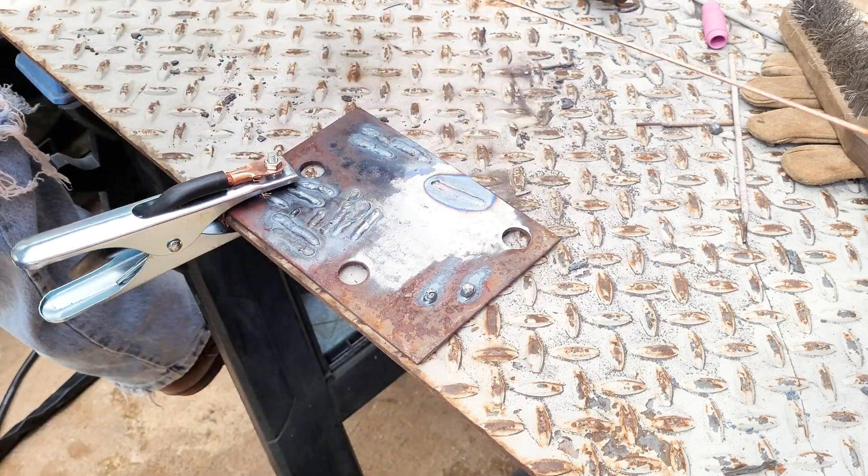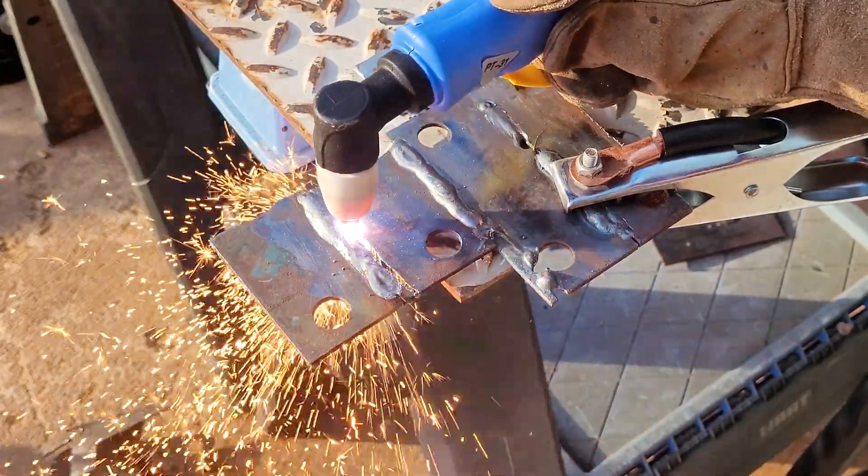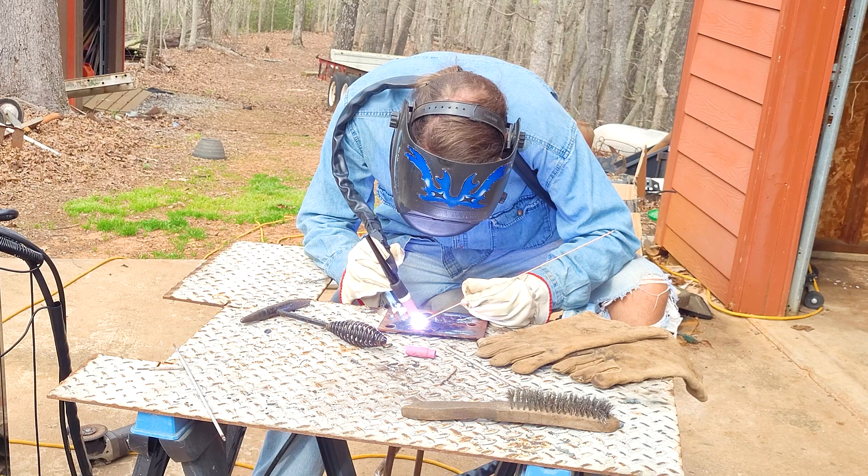So the welder did really well. I was impressed with the TIG — the MIG was good too, I've had the most practice with MIG. But the TIG on this machine is real nice with the high frequency start, real smooth, got a nice arc to it. That was the best process on this machine so far. Stick's good too. Plasma — I would recommend thinner steel with the plasma on this — quarter inch, eighth inch, all day long no problems. It's got plenty of amperage, so if you want to weld some thick steel on 220 you can do it. You can also do 110 volts too, all these processes are the same, just get less amperage using that pigtail. I like the machine. I'll check you out on the next welder review videos — we're going to be using this thing on some upcoming projects. Check you out on the next video, later!